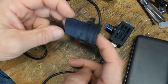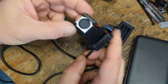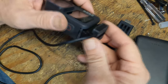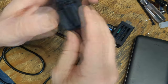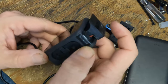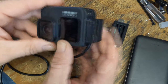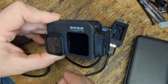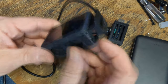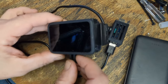It's 3D printed — this one is in ESUN PLA. Of course it can't go out in PLA because if it's left in a car it'll deform and melt. We're going to go with either nylon or PETG for production. Right here is where it sucks in air. It has a divider to make sure that air blowing here doesn't create negative pressure. That was one important thing in developing this — making sure you don't end up with negative pressure inside your camera. Negative pressure is void of air, and air is what cools your machine, even though air is not very efficient at cooling.